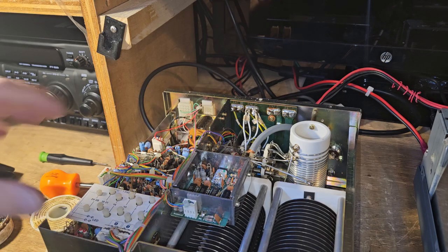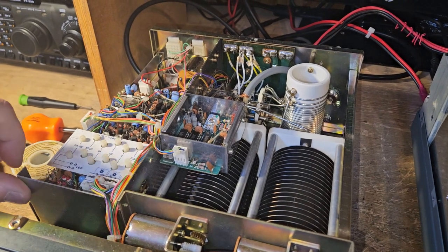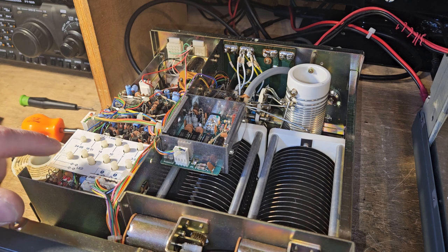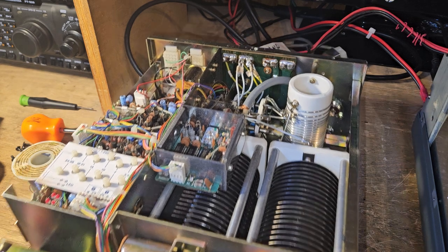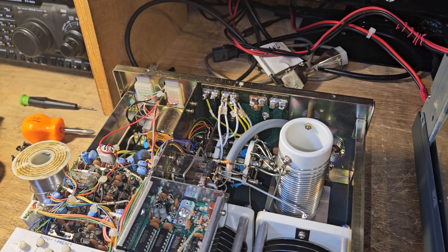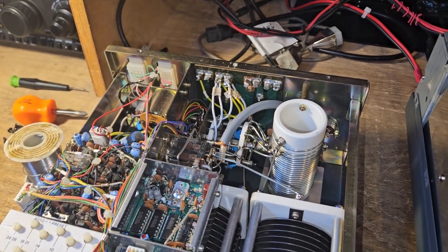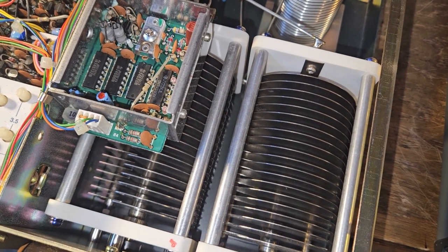You get a little bit of pitting here, which is common for this kind of metal treatment when it gets exposed to moisture. The scheme here is very similar to what I found in my ICOM 761. You can see why this tuner will handle 500 watts — the coil isn't that big, but I guess it doesn't need to be. The real issue with most of these tuners is really the capacitors; the spacing is critical for arc-over and things like that. These all look pretty good.